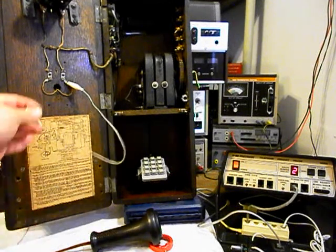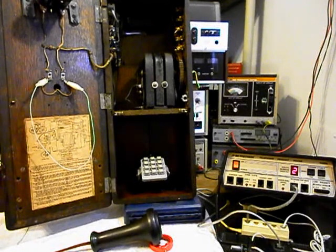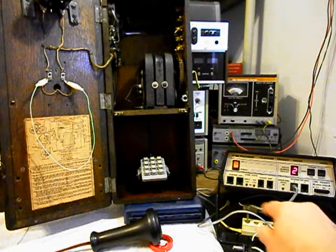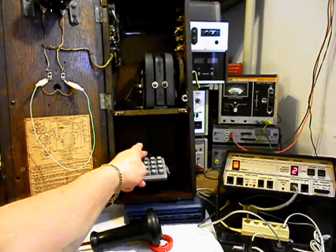We're going to go ahead and short the line out again, the transmitter. We want to push this button on the switch box. That gives us a line out, totally takes the analyzer out of the situation, and we'll call a time and temp number. We'll give you some dial tone, and we'll make that call.